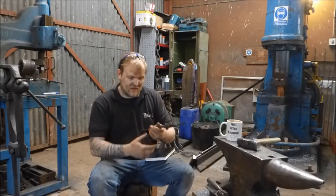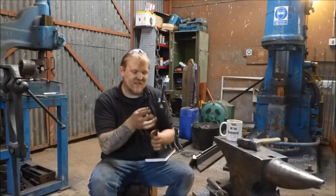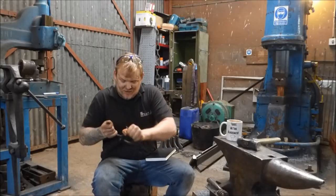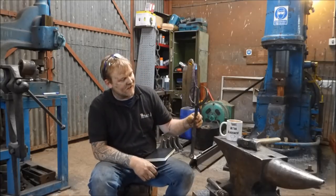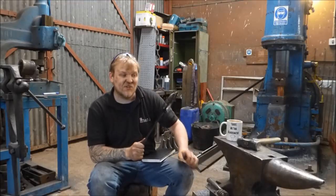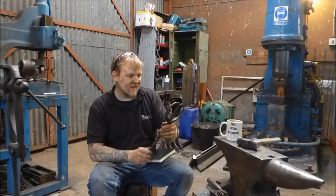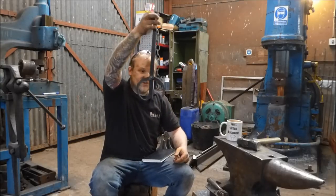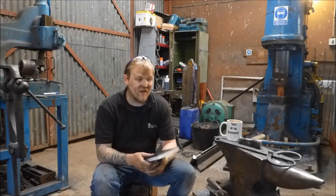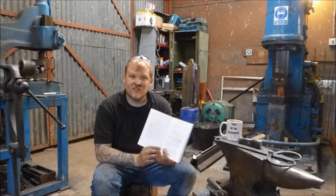The little spring washers work quite nicely. You could open these up quite wide should you require, and the square piece inside locks them up nicely. I would definitely find this very useful — I think I'm going to have to make myself a pair. They took about two hours to make. The reason for the machining is the tolerances — I find that things like this come out a bit more pukka and tidier than average forge work sometimes. This is page 36 and 37, plate 18 — calipers, etc.